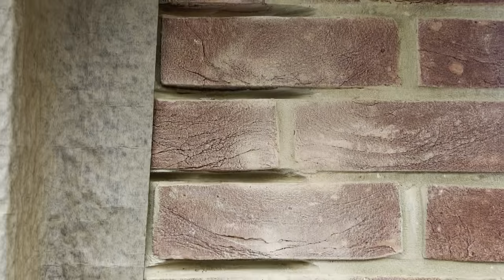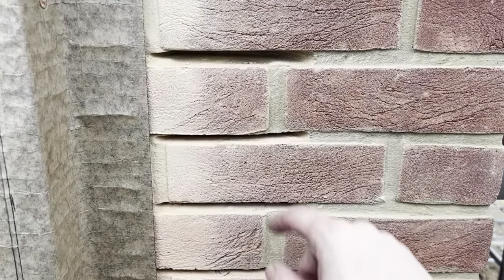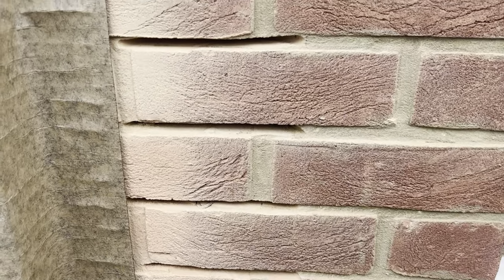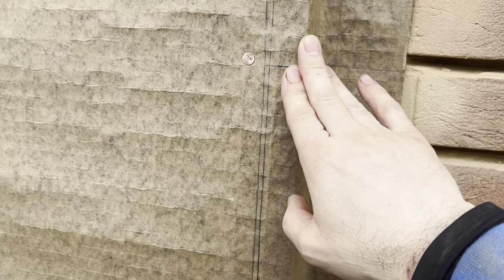And I'm actually going to split that into two, even though it is less than 1.5 metres, because it's going to be fixed in every single welt, just to be safer than sorry. I'm just going to split that into two pieces, and then we're going to have a welt coming down this edge here. So we get that bit in first, and then we can do the cladded cheeks after.